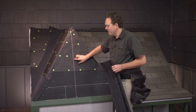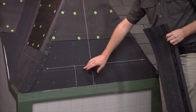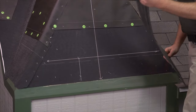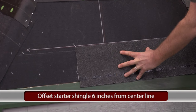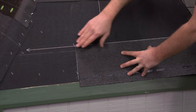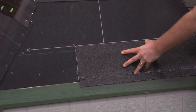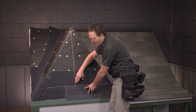I've established my line here in silver. We've got the starter shingle with the top of it marked off to have the correct reveal over the edge. What I've done is created a line six inches off the side of the bond line — the middle silver line you see — and that's where I'm going to start my starter shingle. The reason I offset the starter shingle is because we don't want the butt joints of the starter shingle and the field shingle to line up. The six inches allows us to offset that.